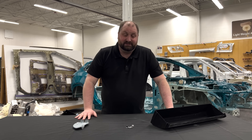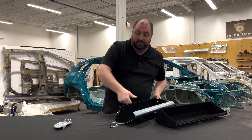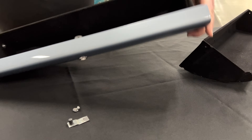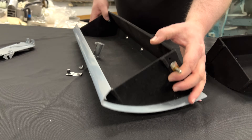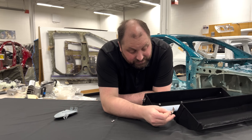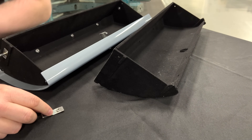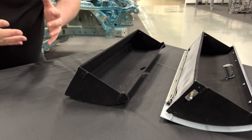Unfortunately it's still a bad design — it's a costly design. So from that conversation, by at least March of 1961, management decided to put a new hole in Bob's glove box. They moved the pin down — you can see Bob's original hole — and just screwed it directly into the side of the glove box. Now the best position would have been the top; however this is still a good enough position to work and does not cause any issues. Now the other issue was a quality issue: you see this rib in the glove box? That was put there as an anti-rotation feature when this is tightened down, because every time the glove box opens and this pin hits the bracket it's trying to rotate and would dig into that plastic.